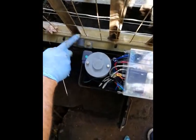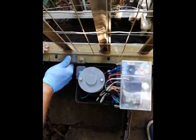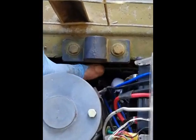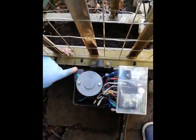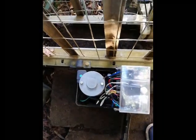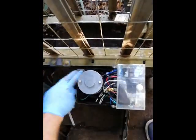Pay attention to this magnet that's fixed onto the gate on this bracket — it must be solidly mounted. Also make sure there's a very small gap between the magnet and the actual motor casing. You want it to pass as close as possible to the sensor without touching the casing. If the sensor does not pick up the magnet, the gate will run into the end stop and malfunction straight away. You can hear it clicking in both directions — it's close enough and doing its job.